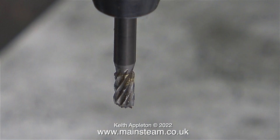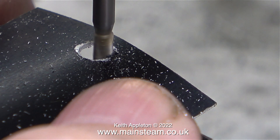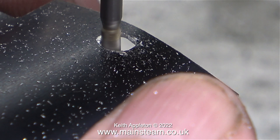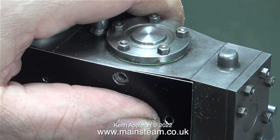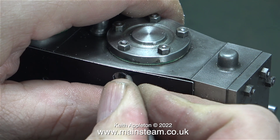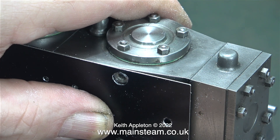I'm using a milling cutter fitted into my Proxon drilling machine — this is an ideal cutting tool for trimming the hole to the right size and also moving its position. The problem is that the card template fitted perfectly, but the cladding has to be bent around the low pressure cylinder, then the holes move, and that's the initial reason why I drilled the hole small in the first place. Here I'm marking the position for the hole where it needs to be changed, and to cut through the anodized layer I'm using the point of a needle file.